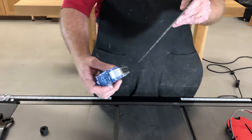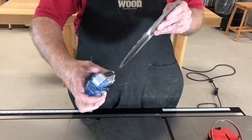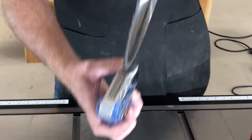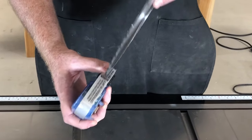What that does is it releases the fuse and a spring throws this aluminum brake pawl into the blade, crashes into it real fast, and stops it. At the same time, the whole system drops below the table. It happens so fast that you won't even be able to see it.